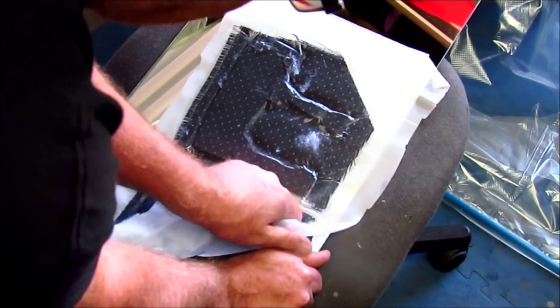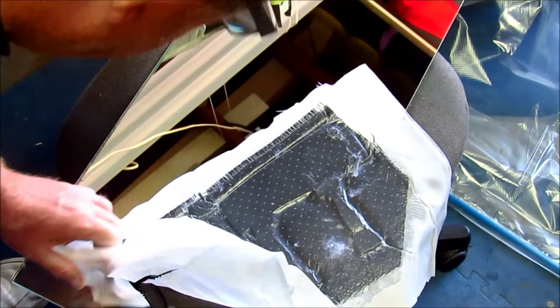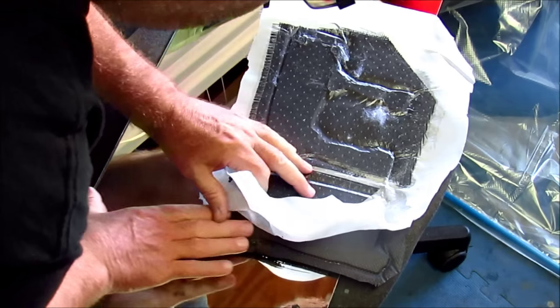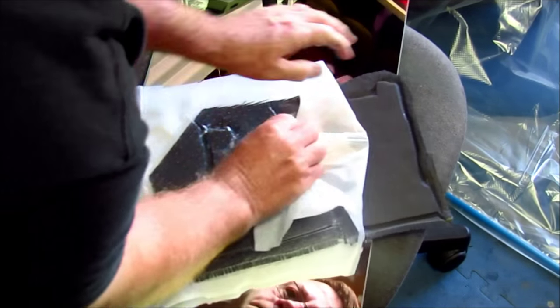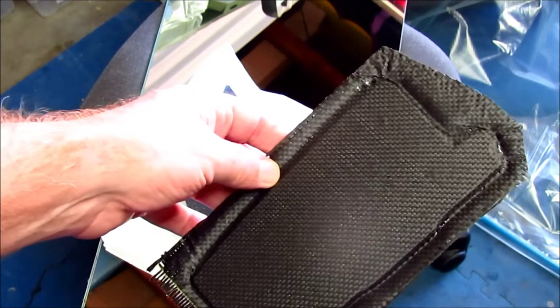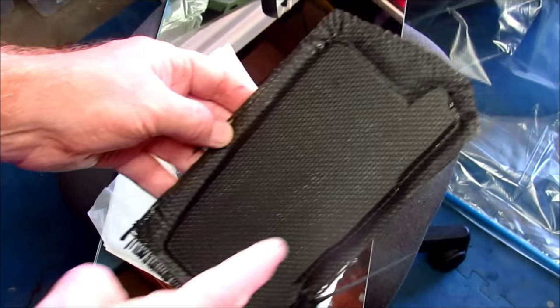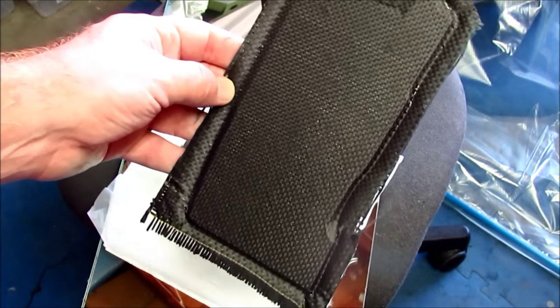But it's hard enough to go ahead and do what I'm doing. We'll get these parts out of here and hopefully be able to trim them and finalize the mounting sequence on the engine firewall. There's one part — this is the baffle that seals up the bottom side of the crankcase against the cowl. This is the inside line of the cowl right here, and this lines up with the various profiles of the crankcase.